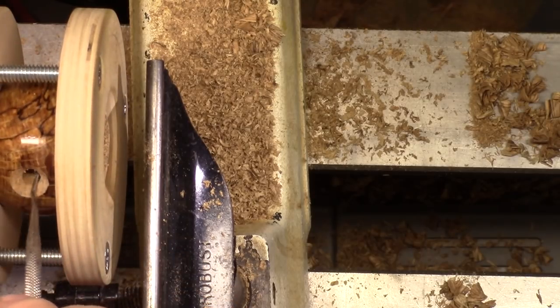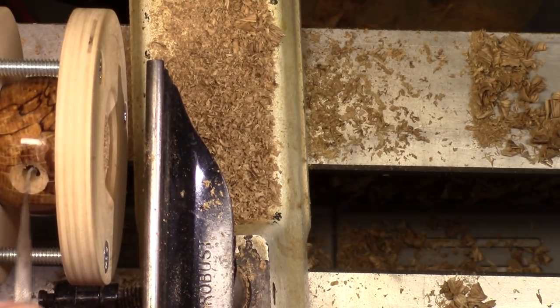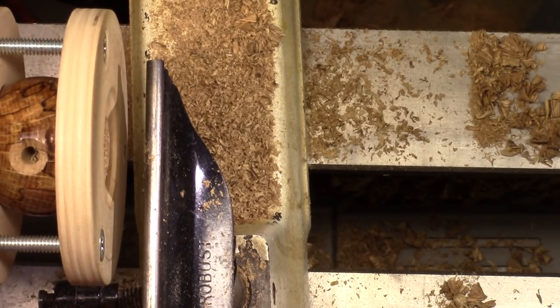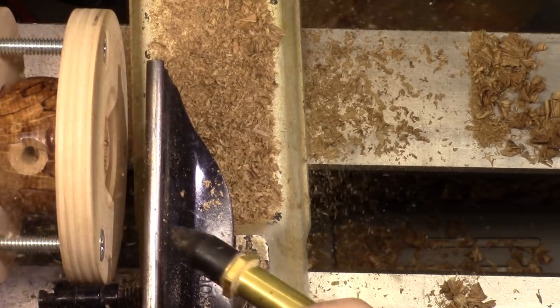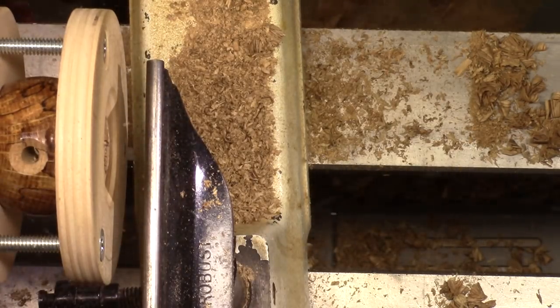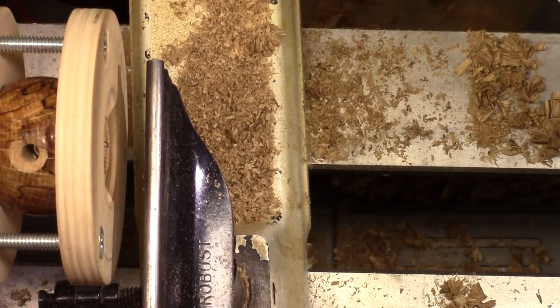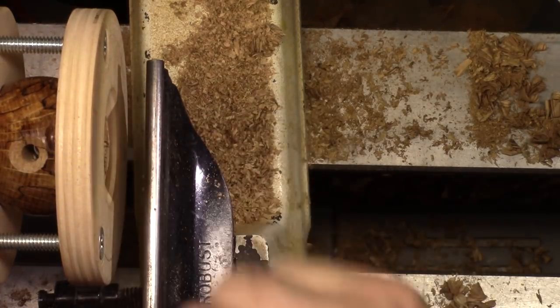Go down to where I've got about 1/8 or 1/4 inch of wall surface left here inside the 1/4 inch hole for it to have a gluing surface for the icicle and finial. And I didn't show all the hollowing process just because I couldn't get the camera situated where you could see what was going on, plus you really can't see inside the ornament anyway. But I got a pretty good relief in there to remove weight.